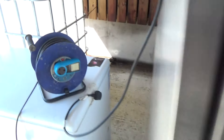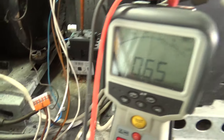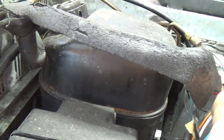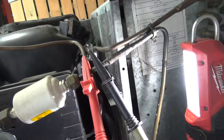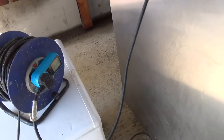Lovely job — that'll do. It was a bit earthy at 0.65. Let's plug it in. We have just plugged it in and it made a horrible noise. That compressor sounds very chuffy. That fan's on the way out. And we are pulling 12.5 amps, but everything's at 35 degrees, so I'm not surprised.